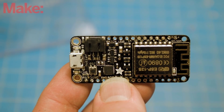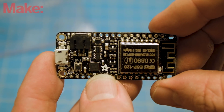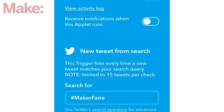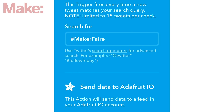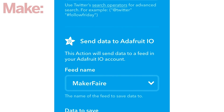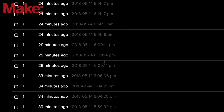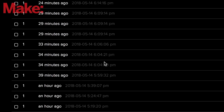I'm using my favorite microcontroller to run the software for the LEDs — the Feather Huzzah. On the back end I'm using If This Then That to perform the Twitter search, and when it finds the right tweets it posts data to Adafruit IO. When Adafruit IO gets new data it sends a message to the Feather Huzzah, which is tied into Maker Faire's Wi-Fi network.